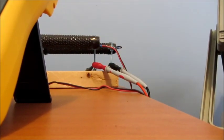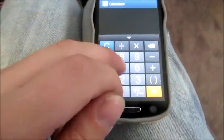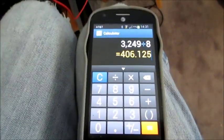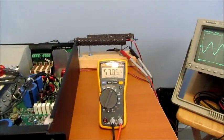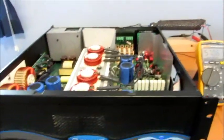So let me make a quick calculation here. Get my phone out. So P equals V squared over R. So we have 57 times 57 divided by 8, and we have 406 watts. So again, this isn't its maximum output power. Its maximum output power is actually 600 watts at 8 ohms. So again, this is due to the sensitivity and also the voltage swing on the sound card of my computer here. But as you can see, everything's working great. So thanks for watching.